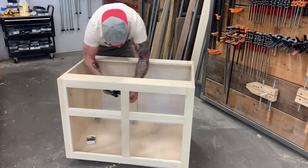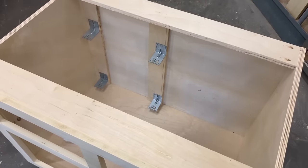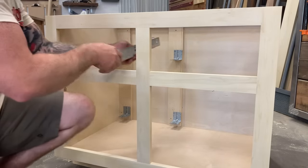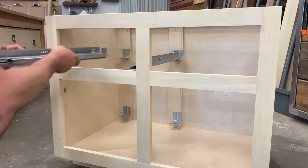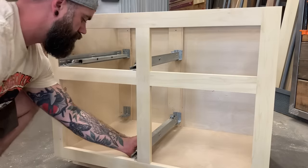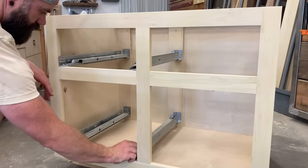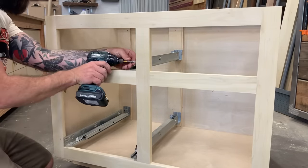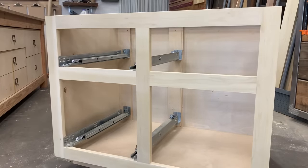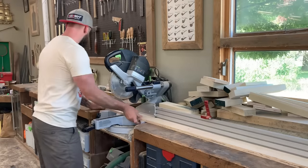The left piece can get pushed into that far back corner and you'll know it's exactly where it needs to be. You will need to measure over from the outer cabinet wall to make sure the right piece is in the correct spot. With our brackets securely on the back of the cabinet, installing the drawer slides is as easy as hooking them into those back brackets — and for over-mount drawer faces they just rest perfectly on the front face frame. Take one small cabinet screw per slide to hold them securely, setting them back about an eighth of an inch so the drawer faces sit flush. That's all for over-mount drawer slide installation.